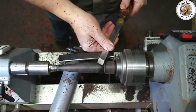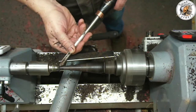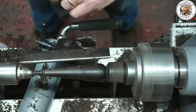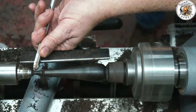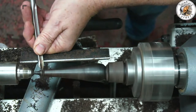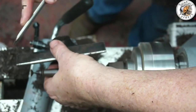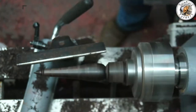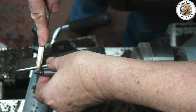Back to shaping the finial. I've marked out where the bottom of the onion bulb would be and I'm now trying to profile it down and get that lovely sweeping elegant profile that Cindy Drozda manages to get seemingly effortlessly. Using a big skew and a small 6mm skew to shape the profile at the bottom and the tip, then back to the spindle gouge paring it right the way down very gently until the knob could be parted off. One-handed skew work takes a bit of getting used to, but once you figure out how to tuck the handle under your arm it's not too bad.